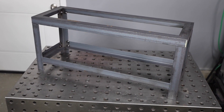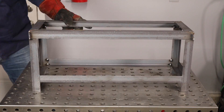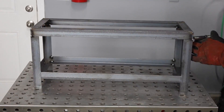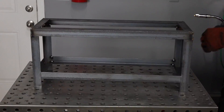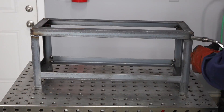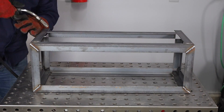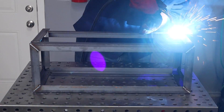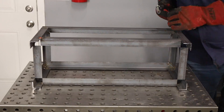I should be ready to weld this out now. I'm welding the whole thing out using the MIG welding process, but you could build this with stick welding or flux core welding if you took a little bit of time to clean off this mill scale. In fact, for MIG welding it would be better to have cleaned the mill scale off to get a sound weld, but the structural requirements of this are really low so it should be just fine MIG welded right over that mill scale.